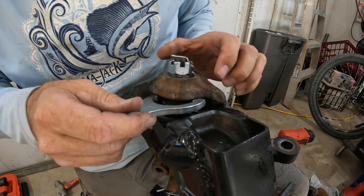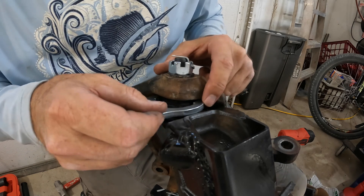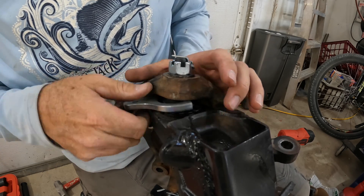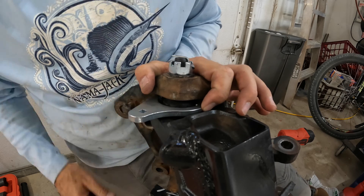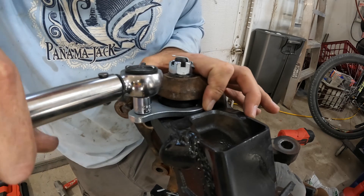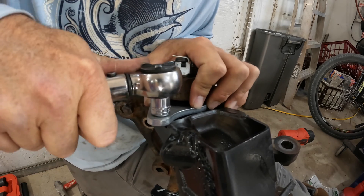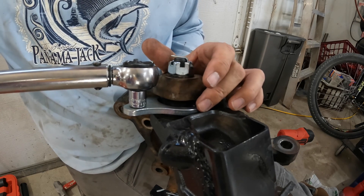I found I had to do this in stages, because if you wrap this end too far underneath there, it tends to jam and you can't get it out. So I just got it to where I could drop it in right there, tighten a little bit by hand. Rotate a little bit more. Now put the torque wrench on here — it's in line. Sometimes it takes some finagling to get it to drop in, but there it goes. So there's 10 foot pounds — 120 inch pounds.